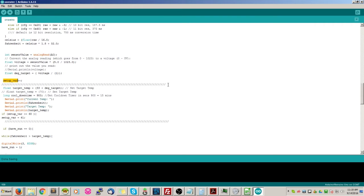Down in this section - this is what I call the changing zone. We create a variable called target_temp and set it equal to 33 plus our degree_target, which comes from our analog reading. This may not be necessary for you. For control and testing I have a float target_temp set to 70, so that way I can test it with a fan before hooking up the freezer.